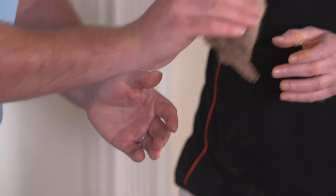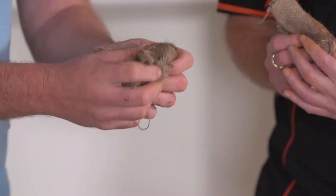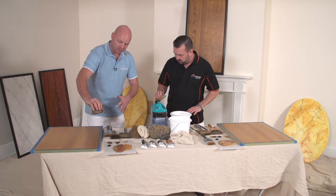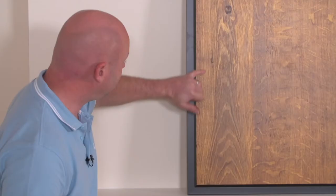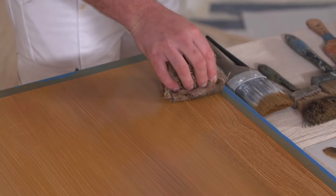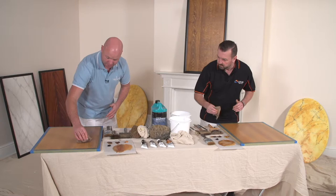If you hold it folded over, you can gently drag it through the surface. If used dry, it would just wipe off the surface. When dragging from top to bottom, I'm going to manoeuvre my hands and fingers slightly as I go, creating that effect — that's when you achieve the really good texture within this particular wood grain. So I hold it at the top and drag through while twisting my hand very slightly. We kind of get a slight curve, not dead straight. Then you can just twist it, and if you give it a little shake, that'll give you that coarser texture within the oak.